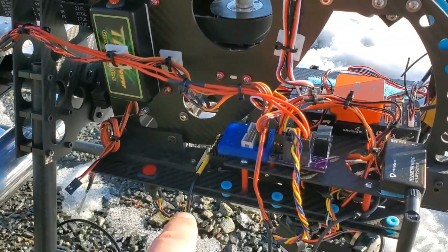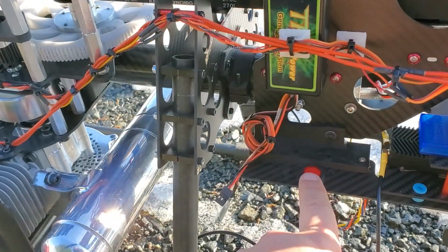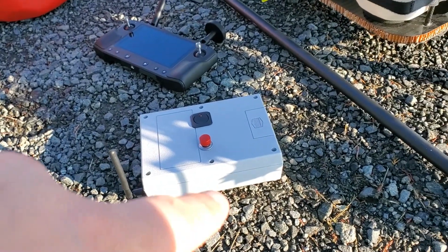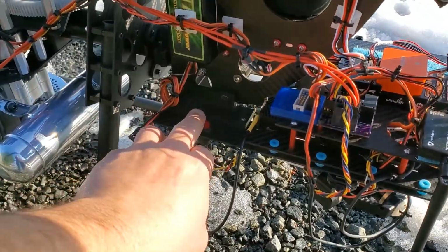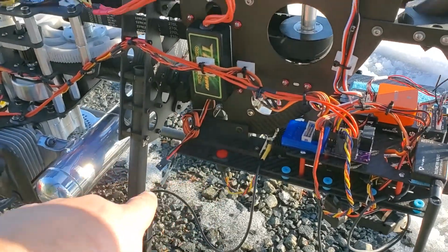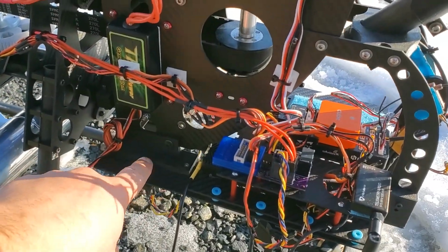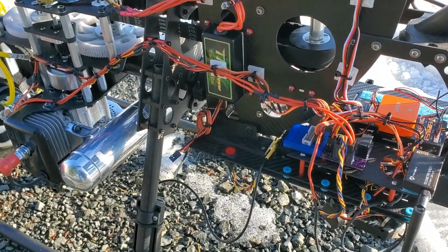which reads the coil. And then we've got a kill system here, which is hooked to this switch right here. This switch has to be depressed, as well as having our link up for our independent kill. When the ignition is live, this will turn red. So you have 2 ways to kill the ignition in order to shut down the copter. The first is this ignition box. The second is this button. So you have an on-copter kill as well as a remote kill.